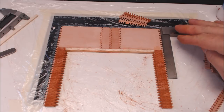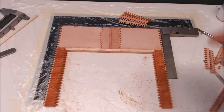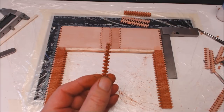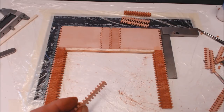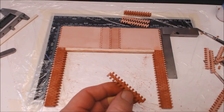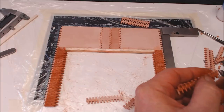The lintel has been glued into the two outer panels and to the ends, but not the middle ones. It needs a good while to dry because it's very delicate. I've used a square to make sure everything is nice and square. Now I'm going to start infilling these bits on the inside - the parts you get at each end of your mold, and also in the brick pier mold - we're literally just going to cut them down so they fit.